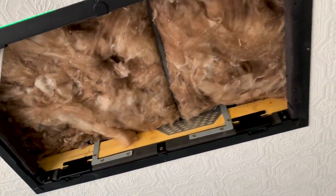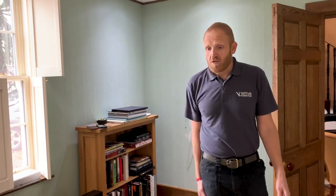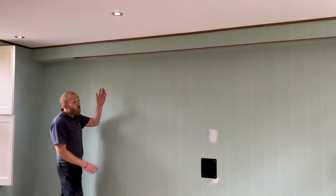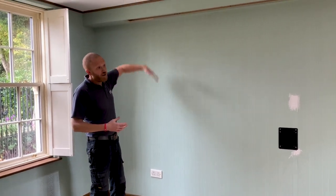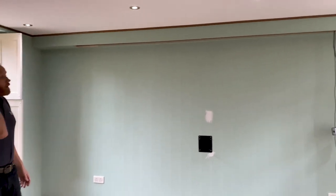The four Atmos speakers are the IC16s. The on-wall speakers are now positioned with cables set — the surrounds, rear and side surrounds, are at the same tweeter height as the front Model O speakers, and the centre speaker is at the same height as well. On the front of the room we're putting a brand new Screen Research 2.35:1 electric screen. There's no TV in here — the client is a hi-fi audio listener who wanted the room in an audio setup configuration. The screen is electric and retracts away; a previous screen was here and we've opened up for a larger three-metre Screen Research screen.